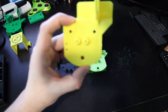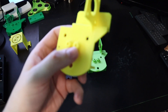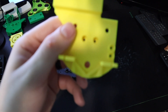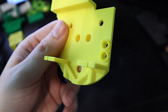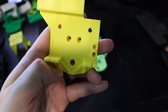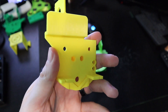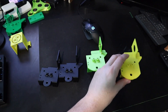This is the final revision. I made these bump outs for the hot end a little taller to keep the hot end further away from the bottom piece, and I also added some additional bracing on the back to ensure it's a really sturdy piece — hopefully no more warping. So far this has lasted over 100 hours and everything has been solid.